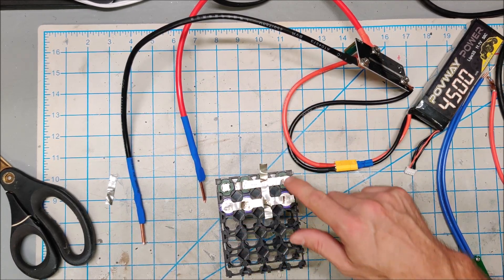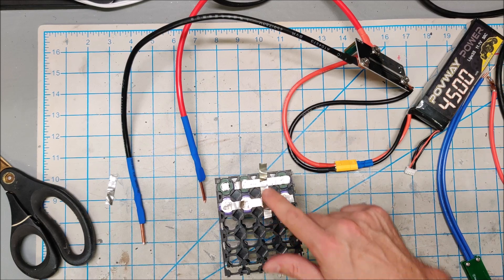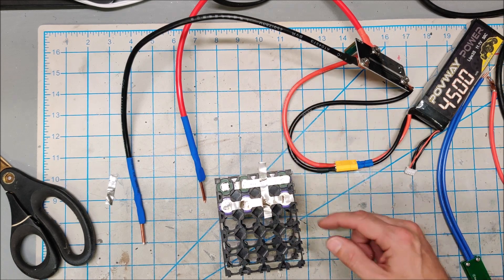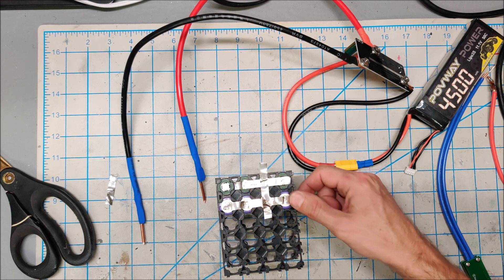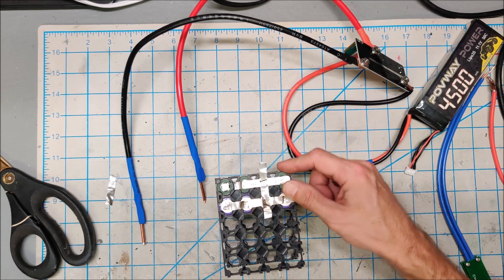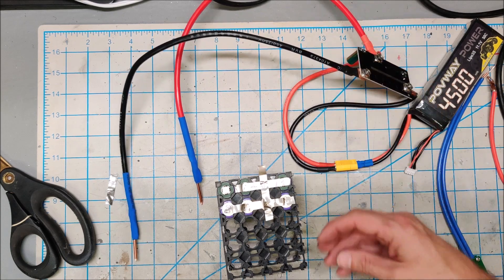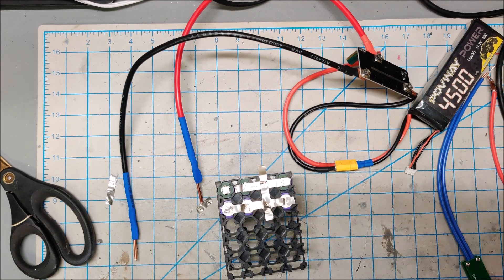This 0.1 — I think if I was to do a battery, I'd probably use the 0.15 across the batteries and join with 0.1, and then later I'd probably have bus bars for additional current carrying capacity. I think this needle upgrade was a great improvement to the spot welder.